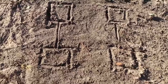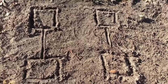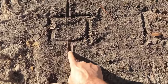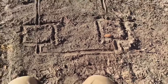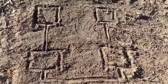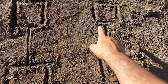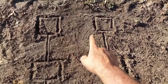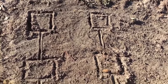15 foot, 1 inch, 1/4 from inside to inside. And so you got to measure that. Now I got to be 36 feet from here to here. Center of post on mine is 36 feet. Oh, and by the way, my square, I have to make sure it's square. So all these have to face it. All these flat edges have to be parallel with each other or flush with each other or square with each other, I guess would be the best term to use.